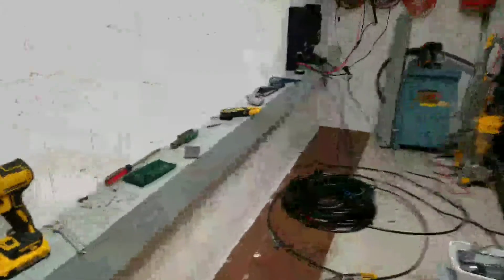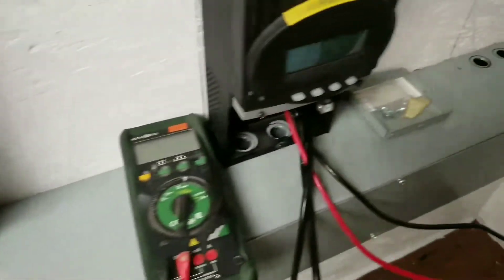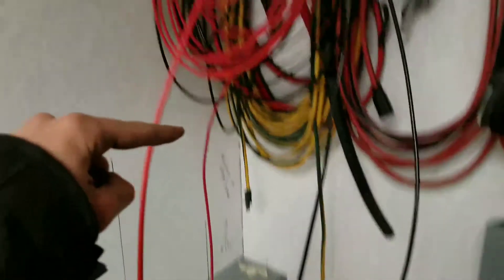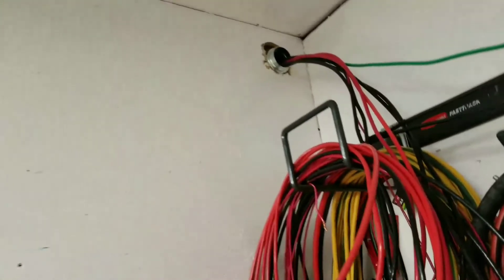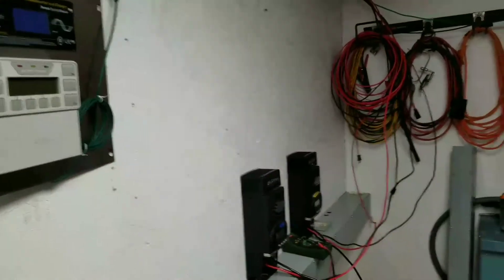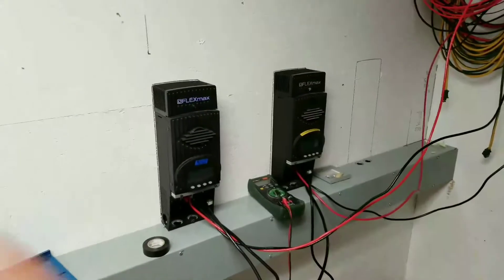Here I am — I have the gutter in over here, and I have my center holes drilled in these Outback charge controllers. This is where they're going to go. I have accommodations for another one ready, and I have it all marked out to run my gutter. I got this trimmed down and my connector in there so I can come in through the back of the gutter once I get it. This whole half of the room will be the DC side, with capability for up to 6 of these FlexMax charge controllers — 2 for now, probably a third one in a couple of weeks.